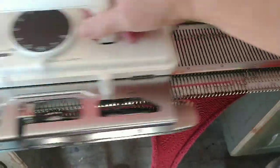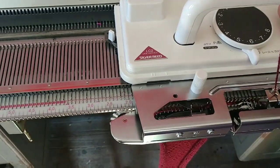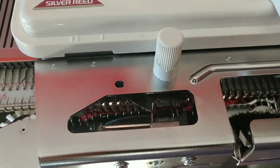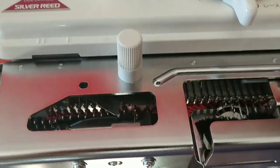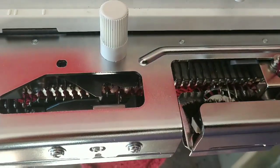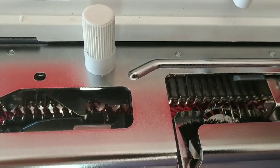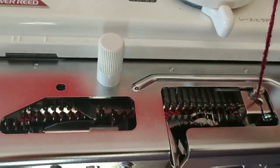So if you have that problem — you see the needle come up, it moves over, but when the carriage passes... there's the needle coming up. When it drops back down, it has to drop down on the other side of the needle that's going to get the stitch. There it is — it has crossed the needle behind it. And there's the needle that will receive the stitch that I'm tapping. Here's the one that's dropping the stitch. So when it dropped down, it dropped on the leading edge of the needle that's going to get the stitch.